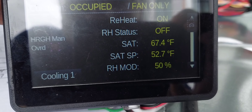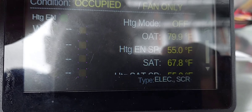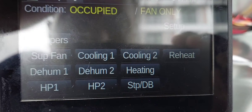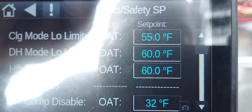There's a C2 alarm right here — that came back. And C1 — look at that. It's probably faulting only because it calls for compressor two first, and because the switch was off, that's that. Now let me show you the reheat stuff right here — got reheat settings. It has an electric duct heater, which I'm assuming is your emergency or backup heat. That's a signal I wired in — it's a silicon-controlled rectifier SCR duct heater downstairs.